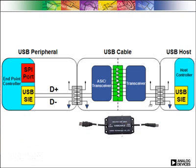Another way is to utilize an off-the-shelf USB isolation module. These are grossly expensive, but they simply plug into your existing D-plus and D-minus lines. They are also large and can't be integrated into a system. They're not a realistic production scale solution.